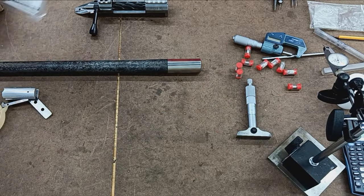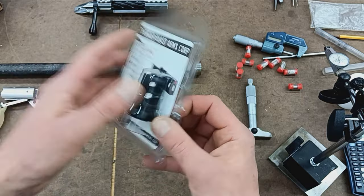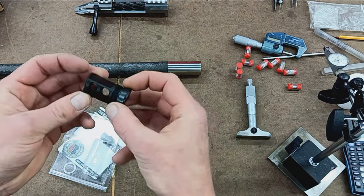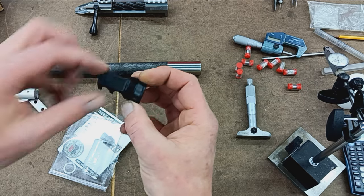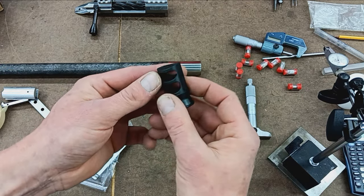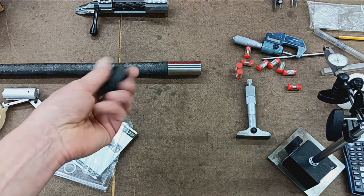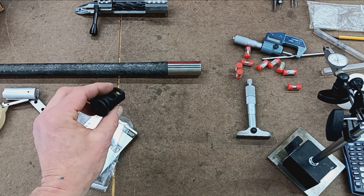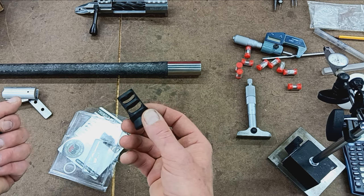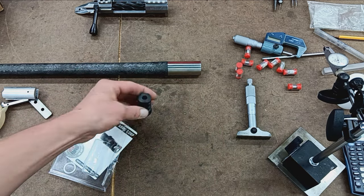There's the barrel, and then the Thunder Beast Arms CB 30 in a 5/8-24 thread configuration — specifically for Thunder Beast suppressors. When it doesn't have a suppressor on it, it functions as a muzzle brake. The top is flat, bigger flats on the bottom, ports are 90 degrees side to side with no angular gas dispersion — so effectiveness as a muzzle brake probably isn't as good as a dedicated brake, but at least it'll reduce the concussion when you do have the suppressor on. Very high quality; I've always been impressed with Thunder Beast. I own one of their 7-inch 30-cal cans and love it — always happy to see Thunder Beast in a build.